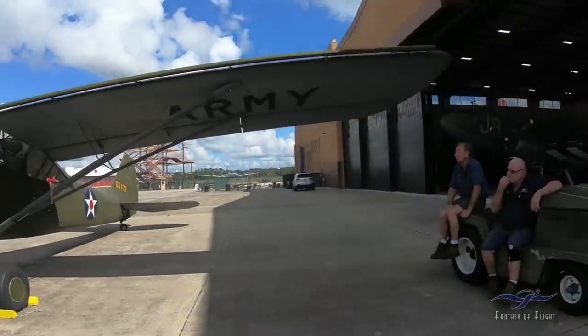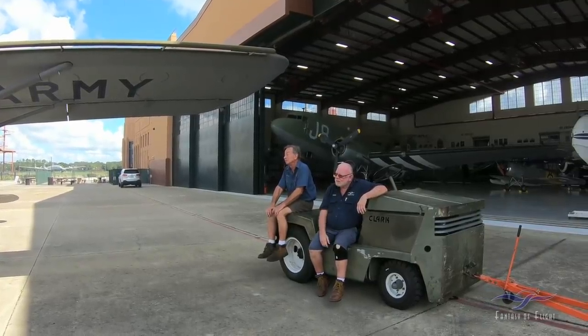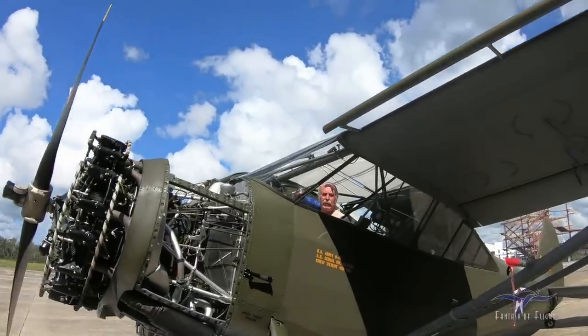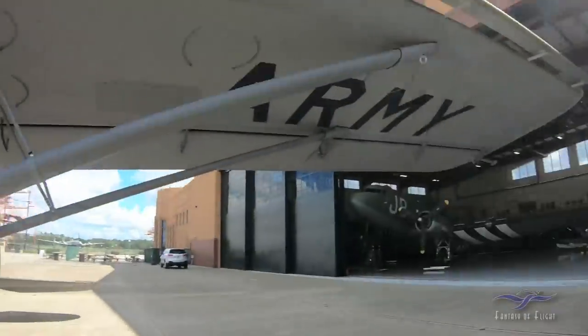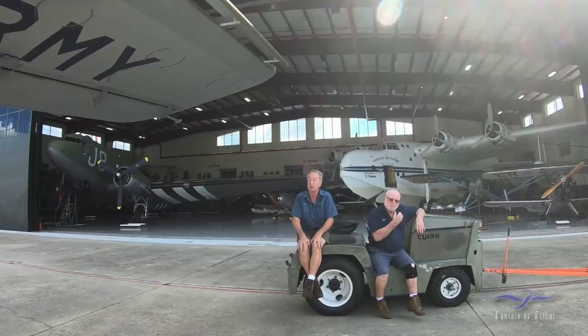We've changed everything. Alright, I guess the mag comes off again. Gotta be the mag. But is there a way to test it, or do you gotta have a stand to test it? Theoretically, it has to be tested at X number of RPM under a certain compression load. I mean, I can spin it by hand and see if we get a spark out of it.